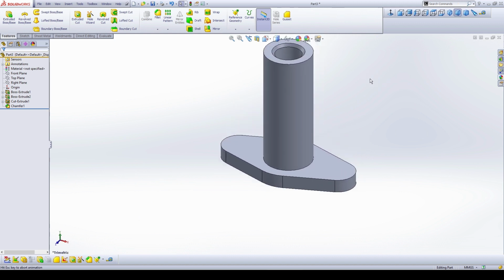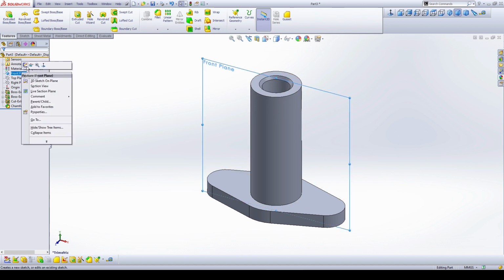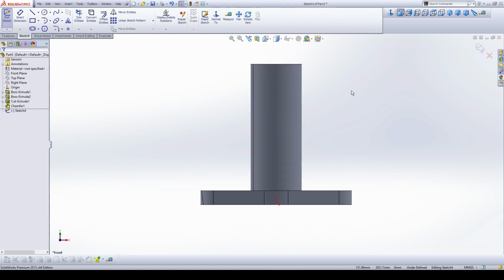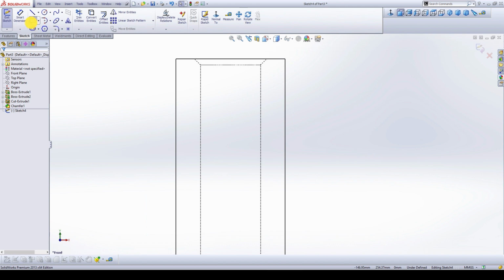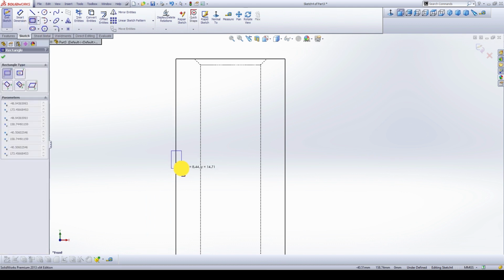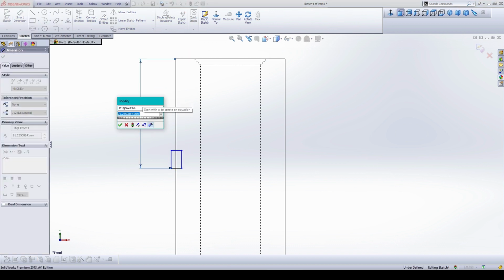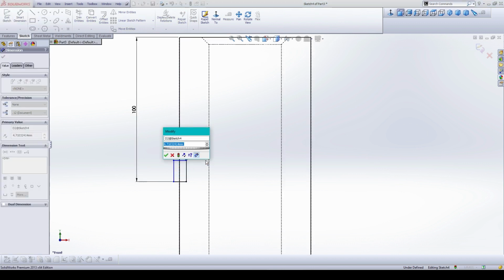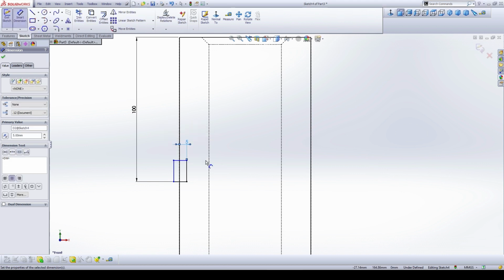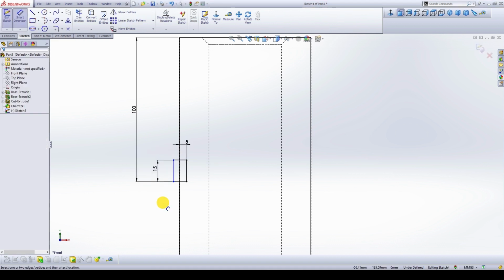Almost done. Again select the front plane, sketch, normal. And change to hidden lines, so we can easily see that. So we make a cut here. We go to rectangle and make a rectangle, make the dimension to be 100, and this to be 5 mm, and this to be 5 mm, and this to be 15 mm. Okay,